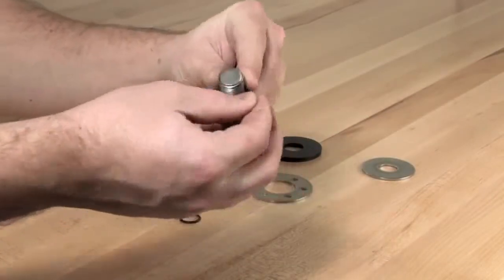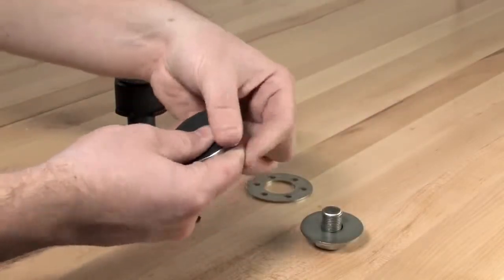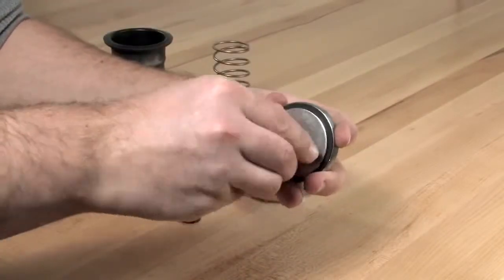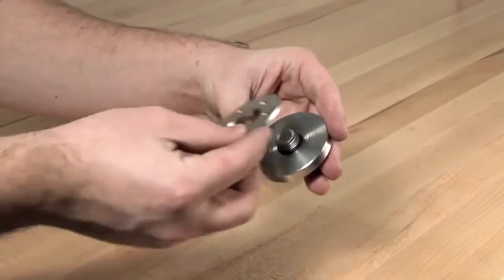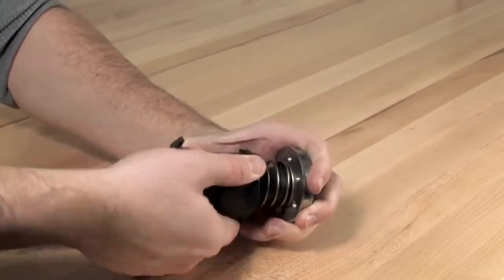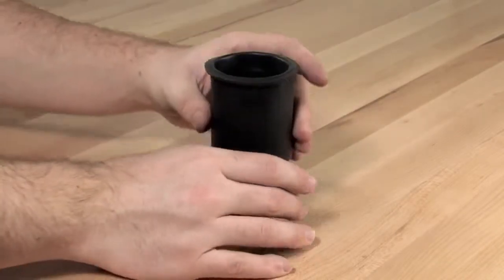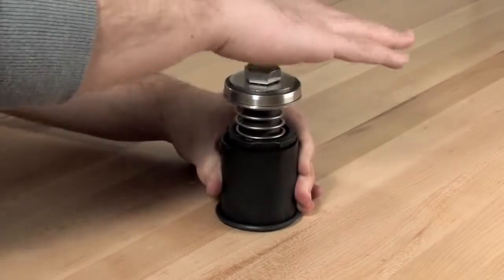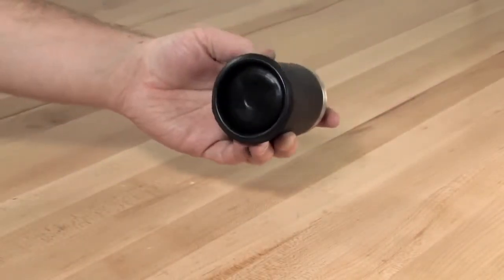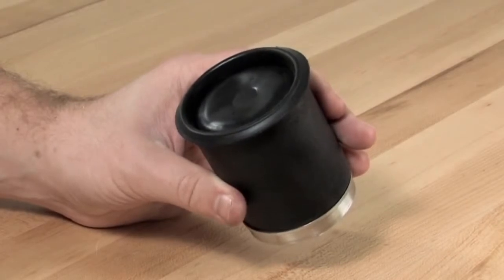To reassemble the relief valve, start by rebuilding the piston diaphragm assembly. With the unit rebuilt, replace the sleeve with the ribbed edge facing upwards. While still grasping the sleeve, fold the top of the diaphragm over the ribbed edge to hold it into place. To properly refold the diaphragm, cup your hand slightly and force the sleeve down over the piston assembly with a rapid slap. If done correctly, the trapped air on the diaphragm will force the rubber between the inside of the sleeve and the outside of the piston. If the assembly is wrinkled, repeat the previous procedure.